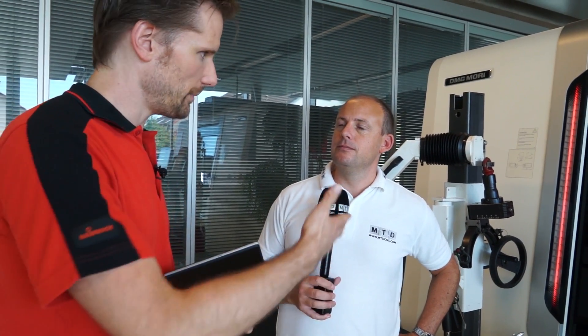Grease maintenance — maybe it's contaminated and has to be cleaned. We found a machine where the hydraulic unit was flawed: the tube had a little hole in it, leakage was larger, so the pressure didn't reach the cylinder. So this will also help you preserve the lifetime or lifespan of your chuck? Of course.